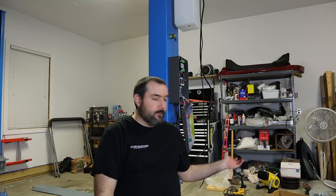So I don't have any issues. I haven't seen any issues with the concrete or had any anchors that didn't torque down. So I'll keep my eye on them, and I might retorque them or check the torque on them after I've used the lift for a little bit. But I'm really happy that everything went according to plan there. Again, you want to stay away from construction joints. You want to stay away from your edges, because that's going to limit the capacity of those anchors.